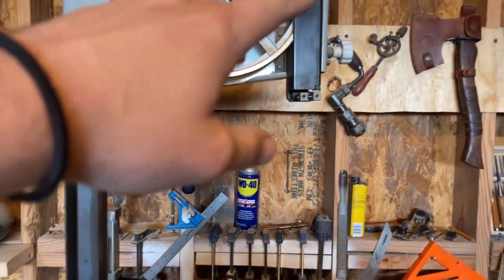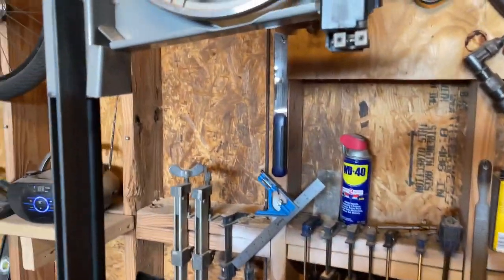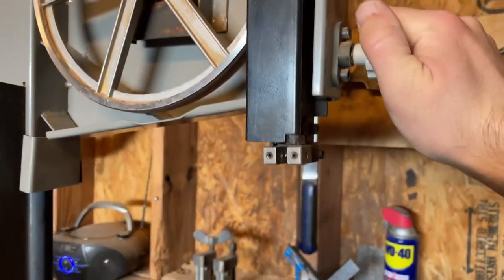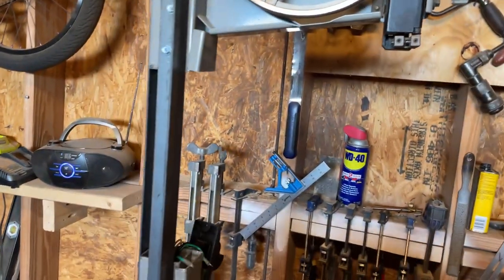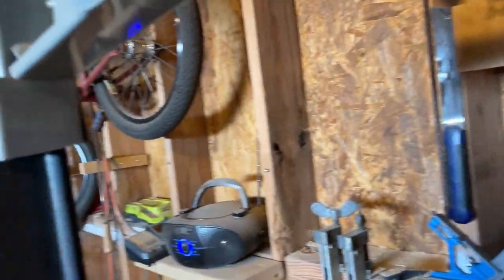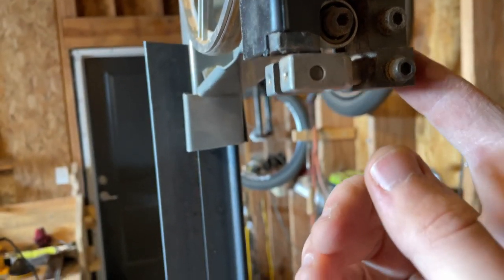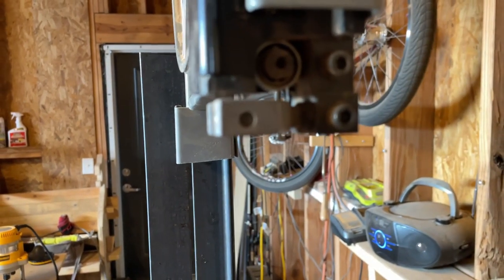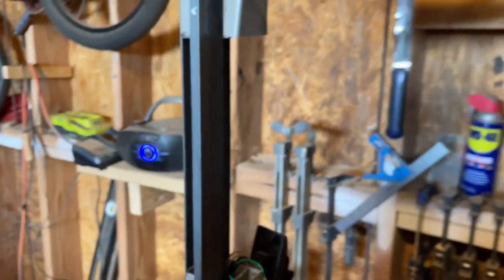So this is, again, 10 inches. I've already measured for the saw blade length I need. Other thing I have to consider is how I'm going to extend the blade guide there. It shouldn't be that big of a deal. It's not too complex. You can see that the guide is held on by the screw here, it looks like. So I could just make an extension, maybe even out of wood or something, to bring it down more so you can extend it. But I'll figure that out.